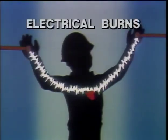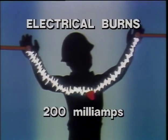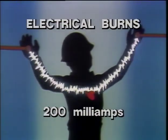The most severe electrical burns result from current flow in excess of 200 milliamps. This is still only 1/5 of 1 amp. Regardless of where the contact is made on the body, this level of current flow can cause deep electrical burns, chest muscle contractions, and heart stoppage for the duration of the shock.